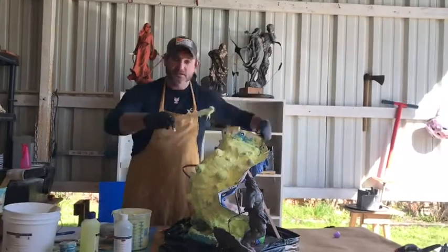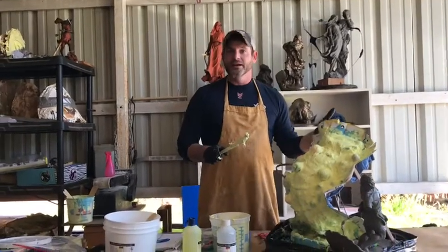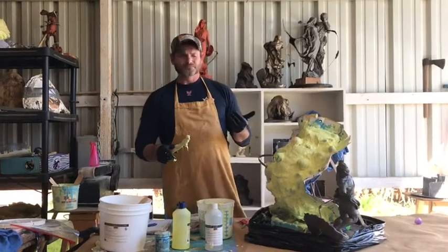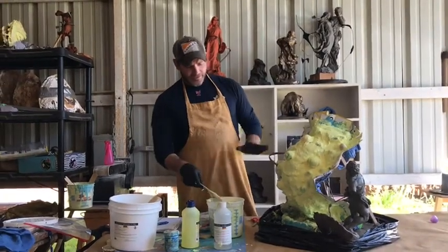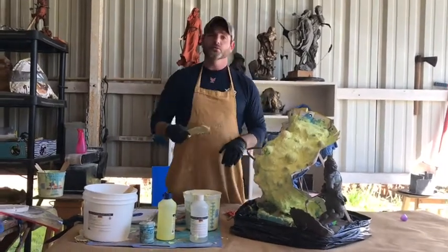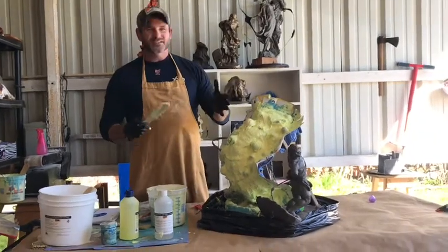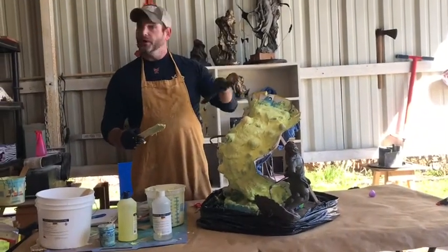When we come back we're going to begin work on our mother mold. Be mindful — we're fixing to turn this around and start all over; the whole process is going to be repeated on the back side. This is where mold making will click in your brain. When we return, we'll decide: are we going to make our mother mold out of plaster, or what I use — Bondo resin. Each one's a bit different, and the mother mold is just a whole other beast to tackle.